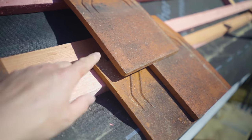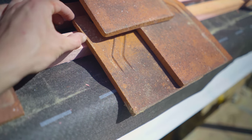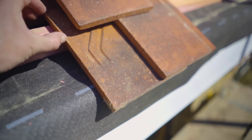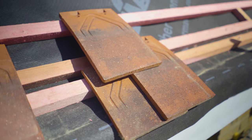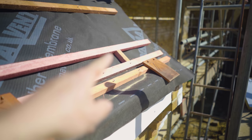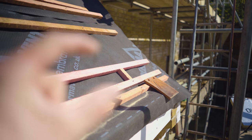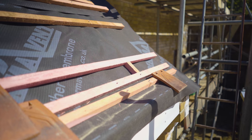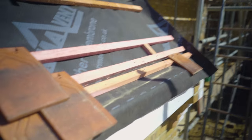I've lapped this at 75mm. I consulted the Bible — which we spoke about the other day — and it says a minimum of 63mm, and 75mm in exposed areas. So I thought I'd give it 75mm because nothing's going to get through that. These battens are 90mm apart. I did read a comment saying you should always go top-to-top to cut out discrepancy, as a few mil over the whole roof could run out. Let me know in the comments if I should be more bothered about that.